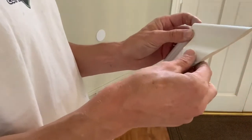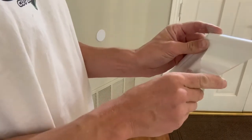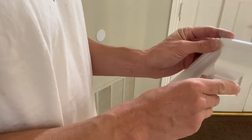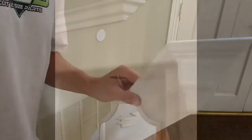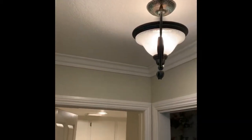You put the glue on one side, spray the other side with activator, and hold it together until it's dry — usually about eight seconds. Now you can hold it up, mark the outside corner on the other side, and it's ready to be installed. That's what the finished corner looks like. Using this glue, we can do outside corners and inside corners — I use miters and Titebond on the inside corners.